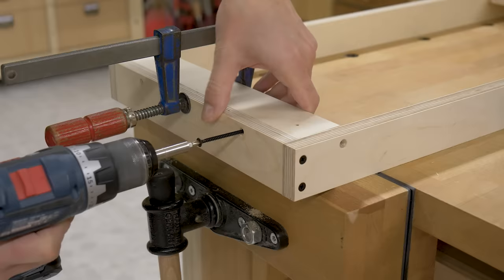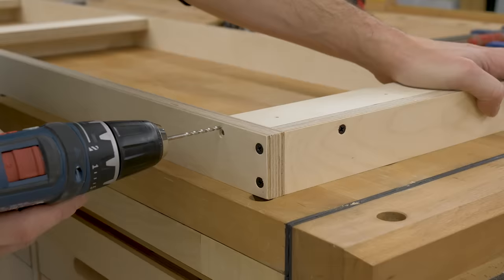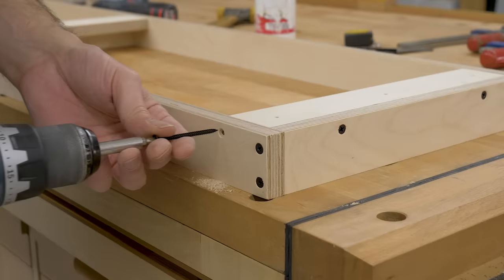It's important that the entire upper part of the frame is level if we want to have a smooth and firm table, but it's not so essential on the bottom. If some pieces are higher than others, we can leave that difference on the bottom of the frame.